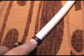A lot of times the plastic will be crimped down on the brass real hard. You might have to take a little razor knife and slice that, but then you can just pop this right out. And wherever possible, of course, it's brass, it doesn't hurt it. Reuse them wherever possible and save you some money. Of course, just replace the plastic.